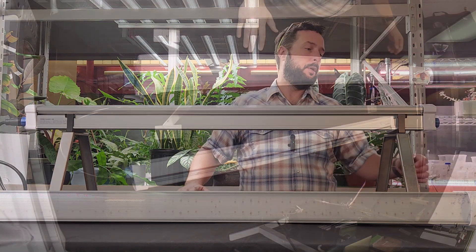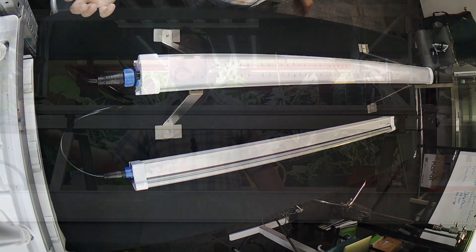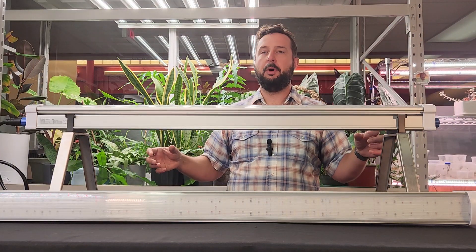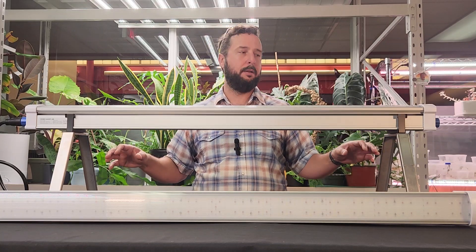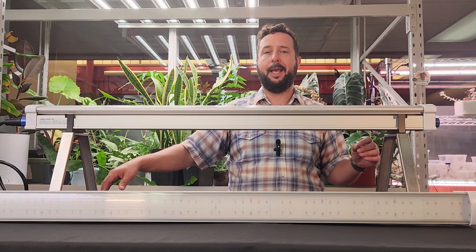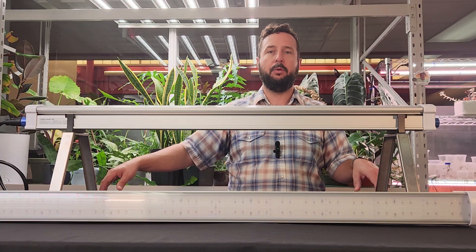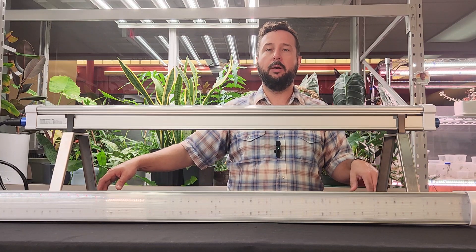The line voltage comes in one end and daisy-chains to the next one, which is great. You can even butt these end-to-end so they become fixed together in a rigid format — though that can be problematic if you have to pull one out. The jumper cables give some flexibility and also help make the turns at the end of the table. Being 160 watts, you can daisy-chain up to 8 of them at 120 volts, or up to 18 at 277 volts, so at commercial voltage you can get quite a few off of one power drop.